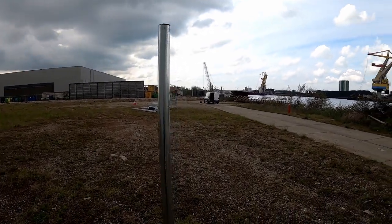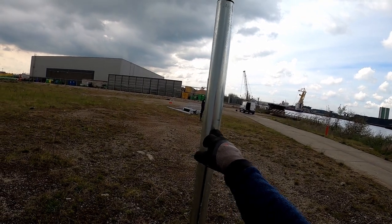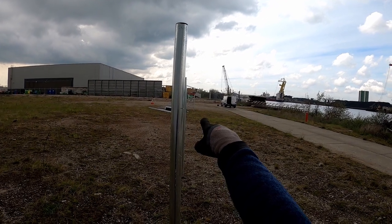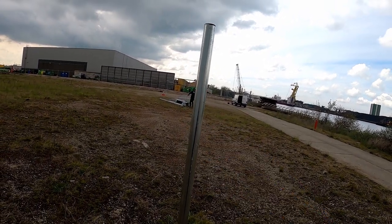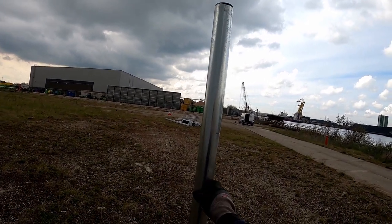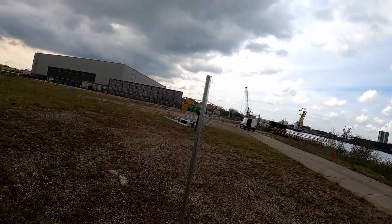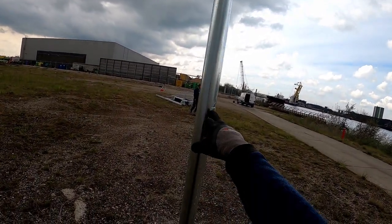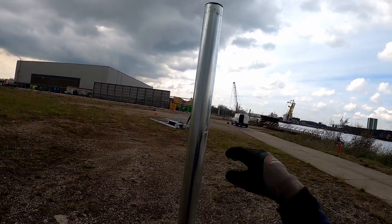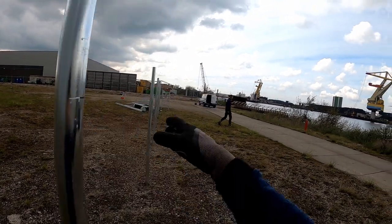So we set our first post. I got here the 40 centimeter mark. So we marked all the posts. And at the end, we got the orange leveler. It's at 40 centimeters. So it's orange because it's high visibility. And you know, all the marks are all on the same height, and I do it all with the naked eye. So yeah, that's how we do it.